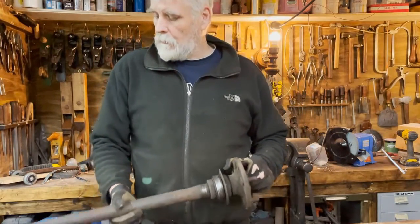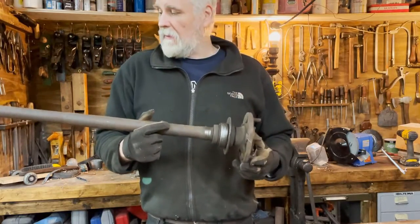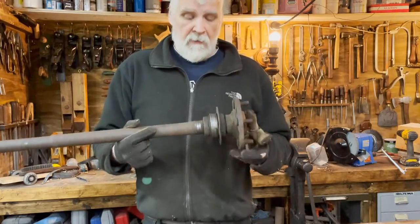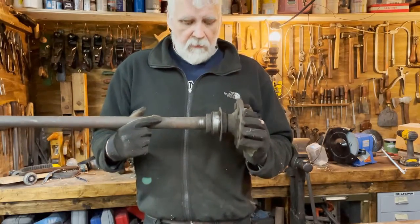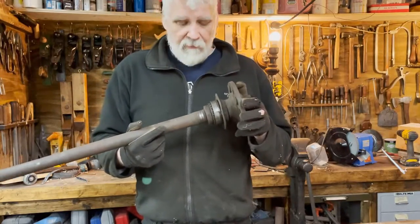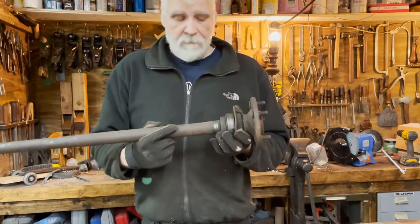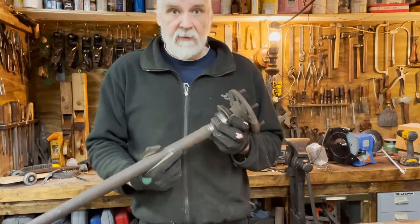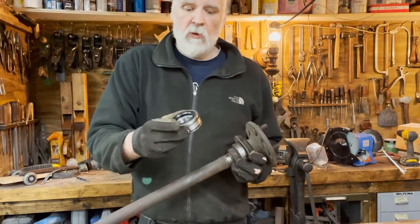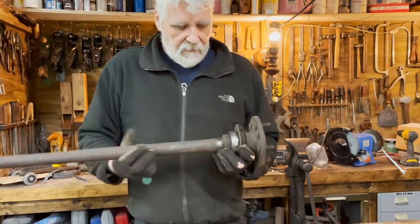This time I'm going to replace the bearing. I guess you recognize this. It's an axle. This is actually an axle from an 8 3/4. It's going to be a little bit modified and be installed in a Dana 60. So the bearing is a green ball bearing, a little bit different than the one that is here, but that's going to be okay.